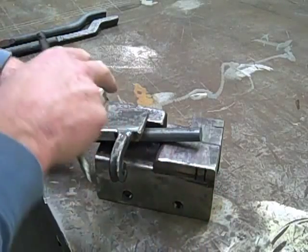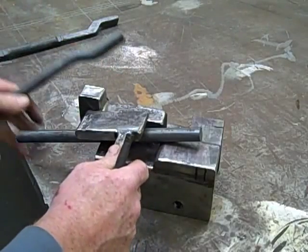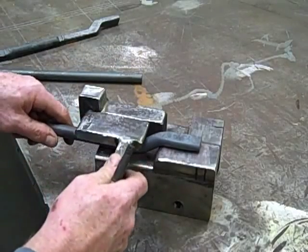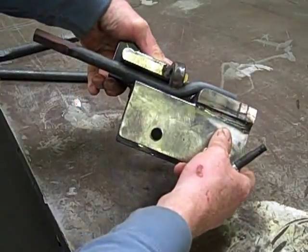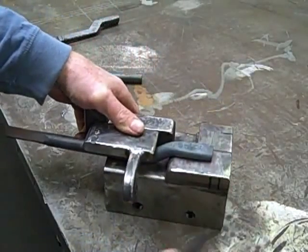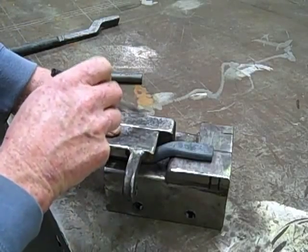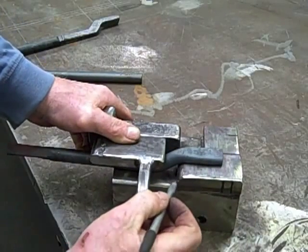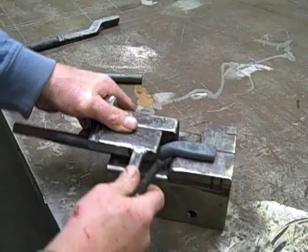What we're going to do is drive this arm down and that will give us our offset. As we hammer that down, you can see basically what's happening. The top die on the air hammer comes down and it stops right here on this kiss block, which gives us 5 eighths of an inch. The distance between here and here is about 5 eighths of an inch also.